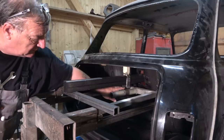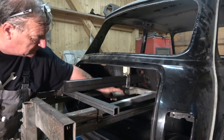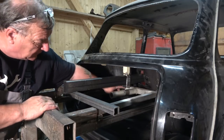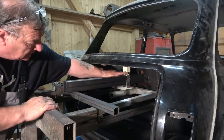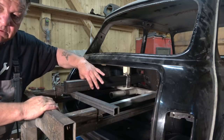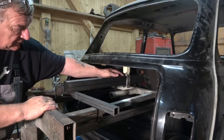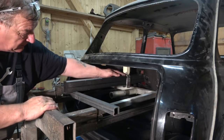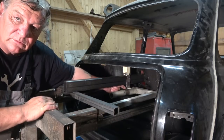You can see I've made this section up. I was going to try and use both of these, but I've realised I'd probably keep the bar in all the time anyway, so I'm going to chop this off when I go to weld everything up. I'll take it all out, seam weld everything, clean it and paint it. I've used this original one, cut it up and extended it because finding a piece of bar or box section that fits over it is impossible — the next size up has a huge tolerance. I had to actually make this leg, heat it and bend it. What will happen now is I'll put a bolt right through here so this can be slid backwards and forwards and then tightened up.